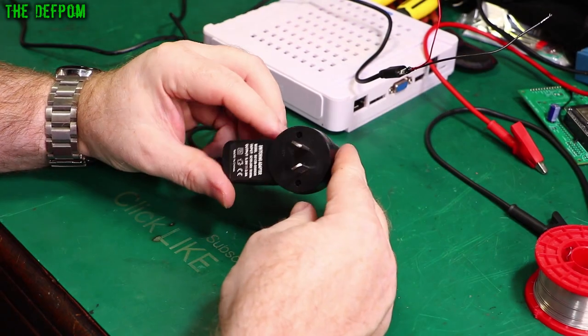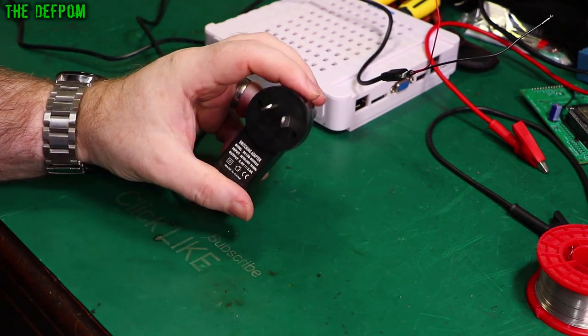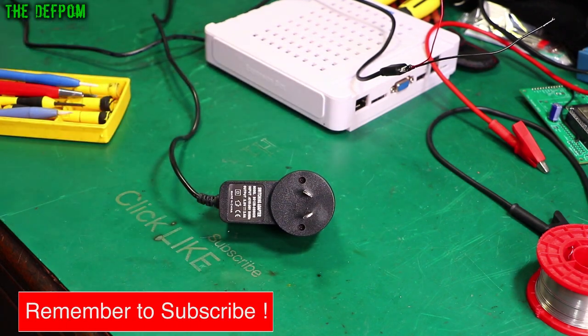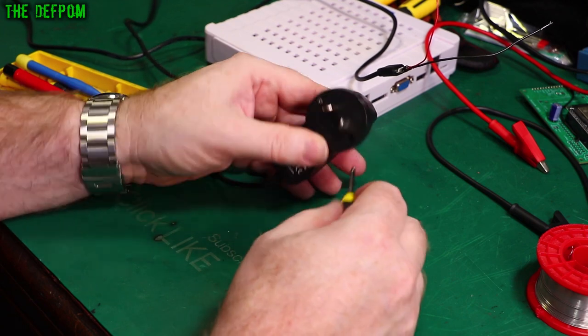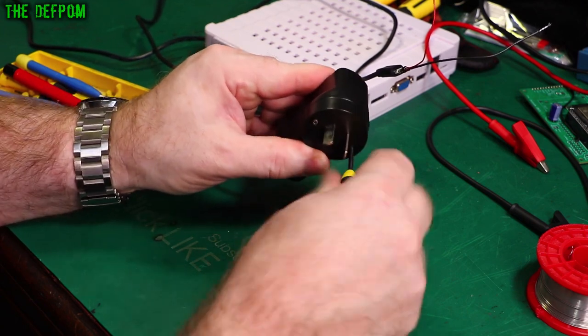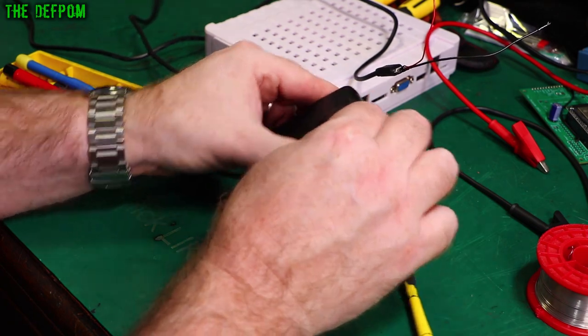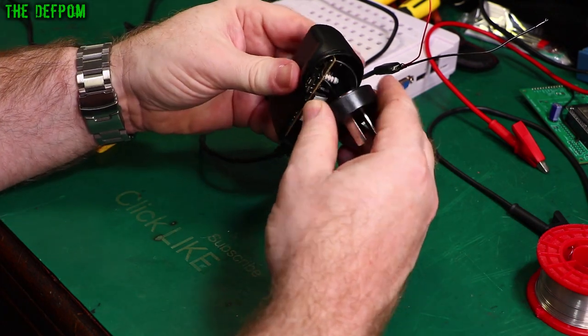Let's see if we can fix this. We're looking quite lucky here — it looks like there are screws in it, so we can actually unscrew this one. I don't have to smash it open, which is always nice. I have to be really careful because there could be charged-up capacitors inside, and I just unplugged it from the mains so there could be high voltages. You should always treat things as potentially high voltage anyway.